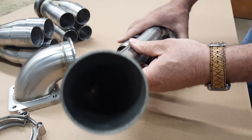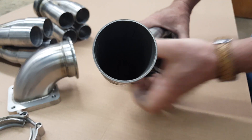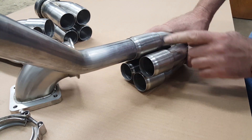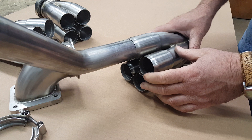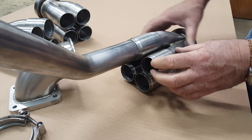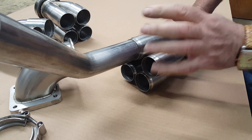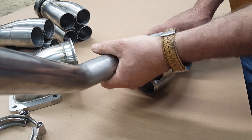This stays as a floating slip joint. You can see how that would greatly extend the header life if, say, three of the tubes were anchored and two of them were floaters, or two were anchored and three were floaters. It would greatly enhance the life of the collector and the entire header.